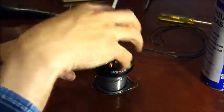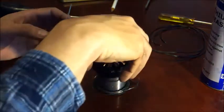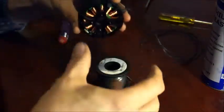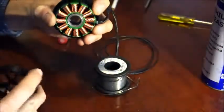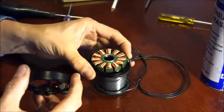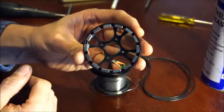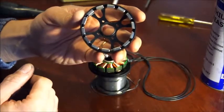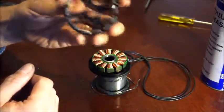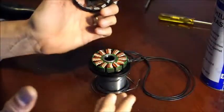Keep in mind those magnets are really strong — they're about two or three millimetres thick. To pull the two halves apart you really have to use a lot of force, and do not get your fingers caught in between the two halves. As you can see, the magnets are very, very thick. Rare earth magnets of that size are actually very strong, so this is in fact a very strong motor — it's just that its diameter could be a little bit wider to give more torque.